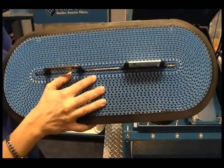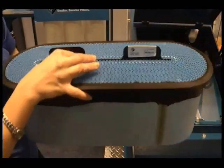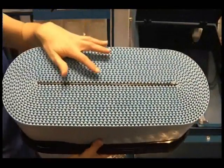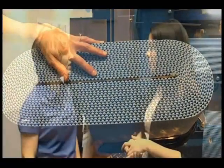One PowerCore filter can take the airflow of up to six eight-foot long traditional filter bags, which means a smaller overall collector for your installation. This will save on either factory floor space or bin-vent consumption. Our CPV collector is up to 70% shorter than a traditional bin-vent filter, which is a great space savings for a tight installation. Our CPC collector is up to 50% smaller than a traditional bag filter — again, a great space savings.